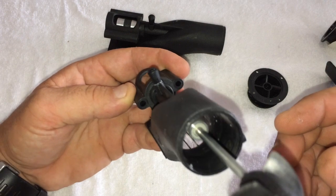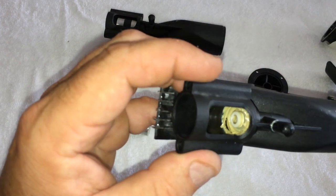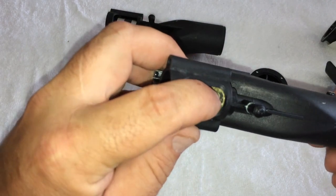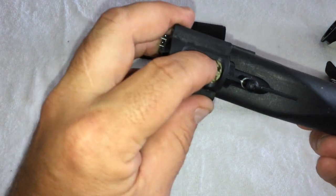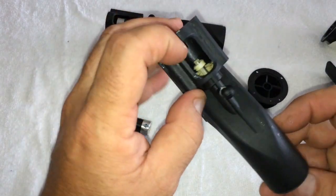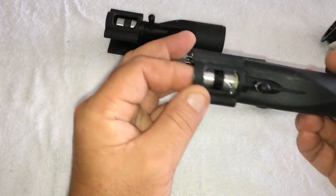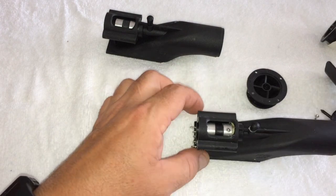You do have a washer on the inside there. One thing I do is — inside there you can see I've got a few extra washers put in. The reason for that is because the motors that I'm using, the shaft isn't quite long enough to reach the coupling as standard, so I put the extra washers in to be able to pack the coupling out so that the motor shaft reaches.